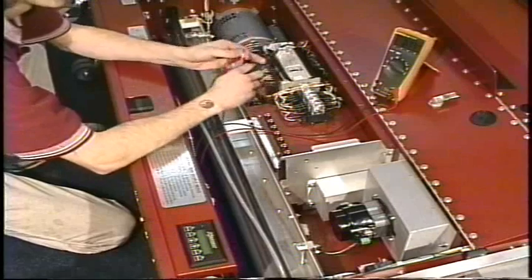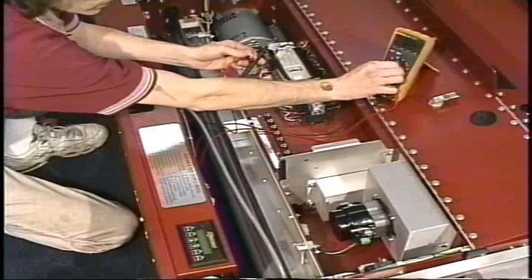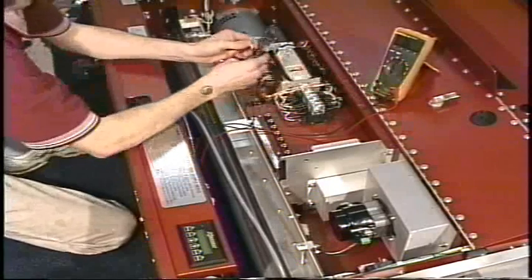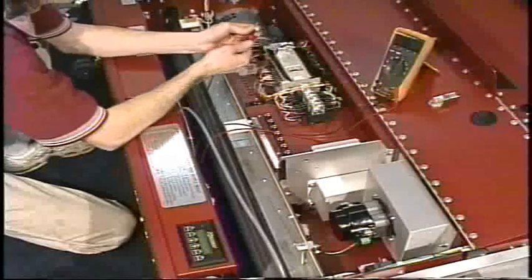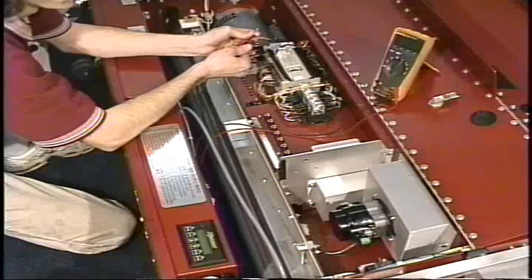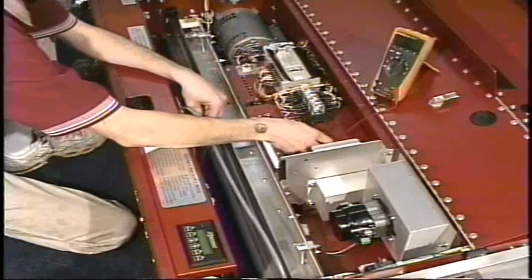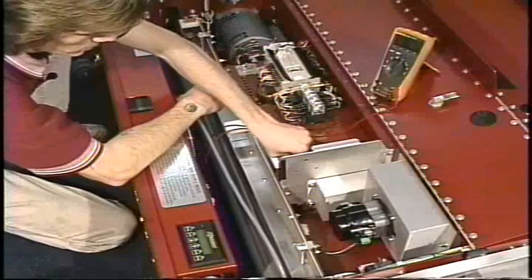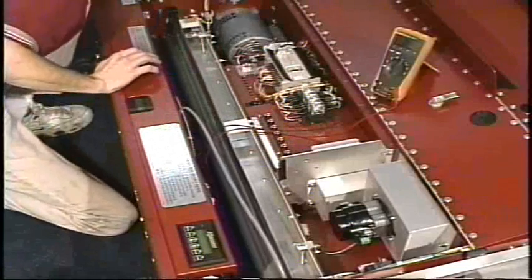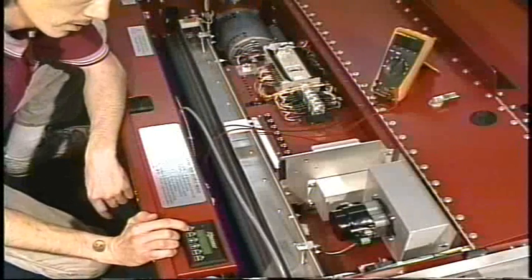From this point, we're going to have to change our meter from voltage AC to continuity. We'll put one lead on one end of the fuse and the other lead on the other end — and that's showing us that that fuse is good. So theoretically, if we were to replace that fuse, the circuit should be complete. When we plug our lane machine back in and go to that output, we should be able to turn that motor on.